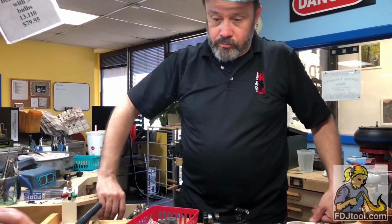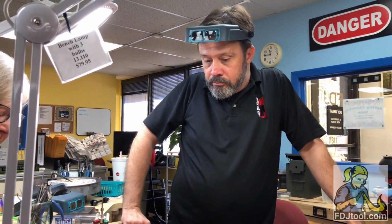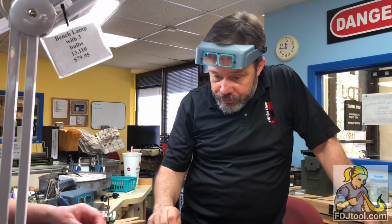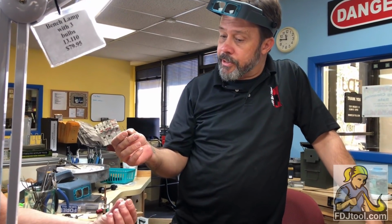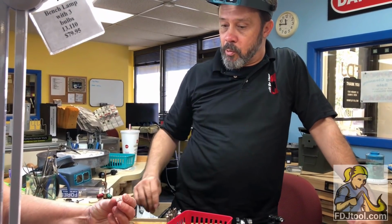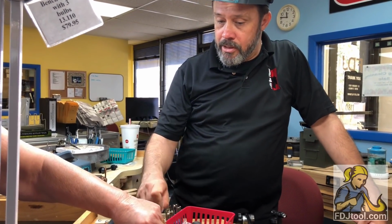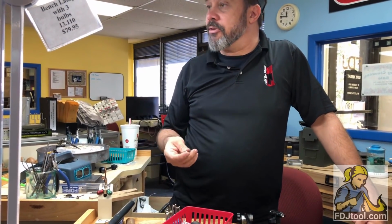So what did you use to make the box? It's just sheet. Yeah, I threw that together in about 45 minutes last night. I used a little cross-cut cylinder burr to cut the notches. And I went back with a file and just made sure that they're a little more square to fit the square wire. If you use round wire, it will snap right into place. And then I went back with a round burr and cut off the excess. And then that matched close enough to make a seat.